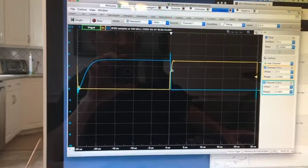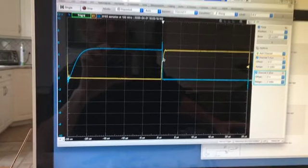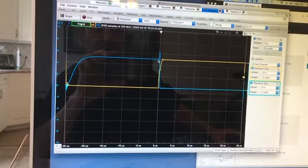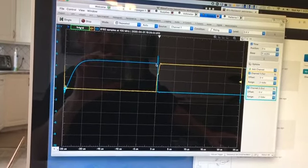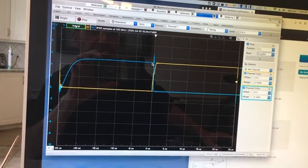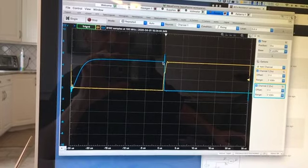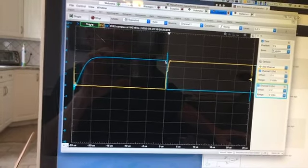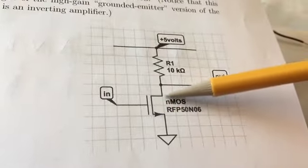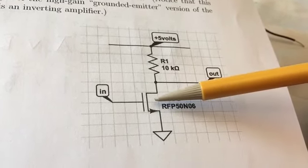And that's because when this NMOS logic gate goes from high to low, you have sort of the capacitance of the MOSFET being very quickly discharged down to 0 through a very low impedance path to ground, because the MOSFET itself, when it's turned on, makes a very low resistance path between the drain and the source. It's like just a few ohms or a few tens of ohms.